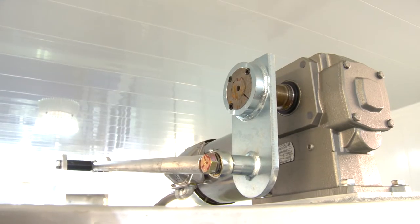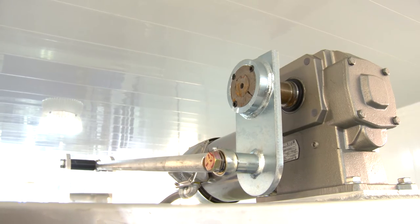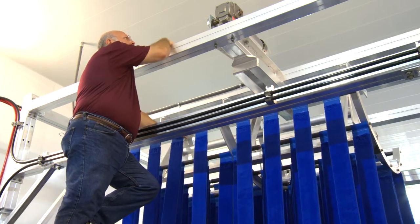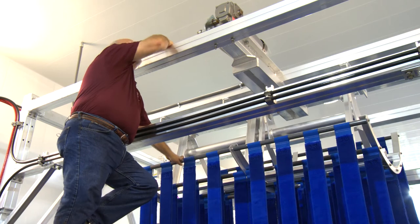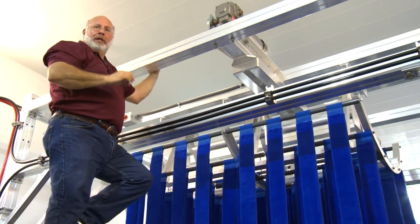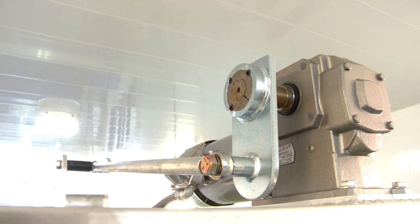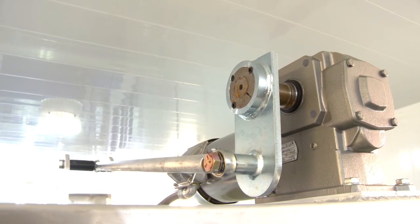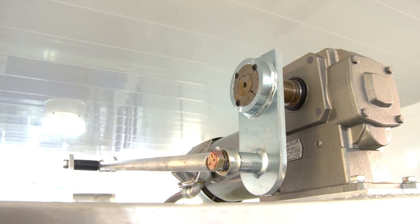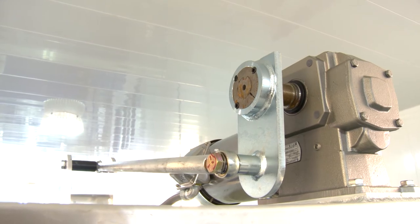On the mitter itself, there are two bearings — everything else is plastic UHMW bearings. The bearings are up on the pitman arm, one on each end; they're rotational. We'd like to grease them on a weekly basis. During your cleaning program, have the guys go up on top of the mitter with a ladder — make sure it's turned off, locked out, tagged out — and put two squirts of grease into each one of those rod end bearings.